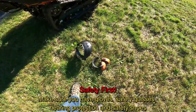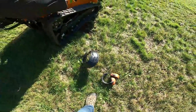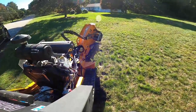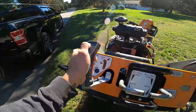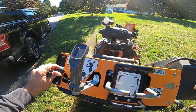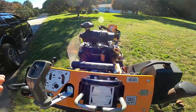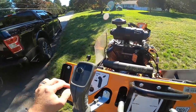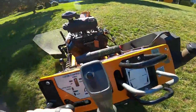So I'm going to show you the operation now. First off, you want to make sure you have safety shoes, ear protection, and I'm going with this grinding mask here because these things do tend to throw some stuff back at you. Now to engage the blade, you pull this trigger and hit the button. To make a pass, you move your joystick left and right. It's a combination of movements — you bring this down and make a pass with the blade running right to left or left to right. Once you've made that pass, you lower it just a little bit more and do the same thing. It'll probably take you a couple tries to get used to it, but it's fairly simple. There's also a shield on here — if you move it to the side, that blocks debris from flying at you if you're standing on the control side.